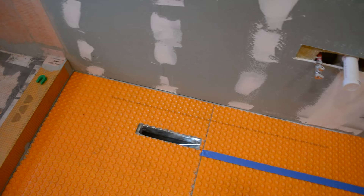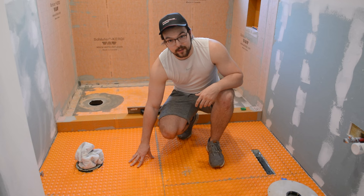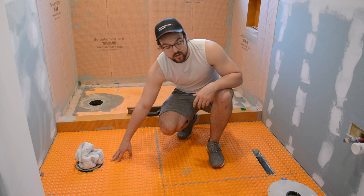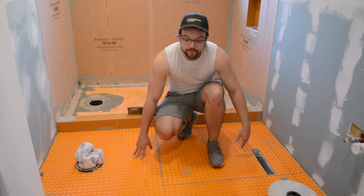It's now time to start laying out our heating cable. It's designed to go perfectly in between each of these studs so it's held down in place. There are a few rules to keep in mind: you want to stay about seven studs away from your toilet flange so you don't melt the wax ring. You also want to stay about four studs away from an HVAC vent so you're not overheating that area.